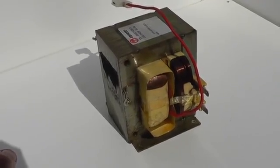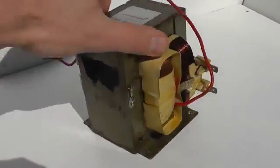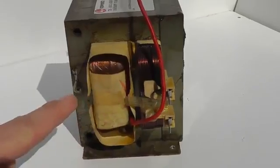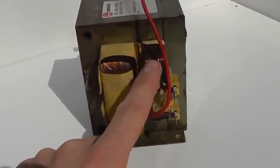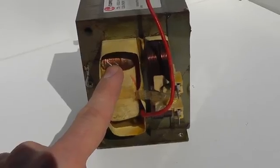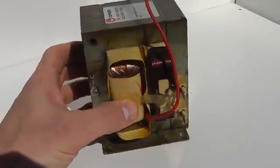In this video we're going to be looking at transformers, and here's an example from my microwave oven. It consists of two coils, a primary and a secondary, and these are surrounded by a very substantial piece of iron. The iron goes through the middle of these two cores — this is what we call an E-core, forming an E-shape with an end plate on it. The primary is much thicker wire because it carries more current, and the secondary has a lot more windings. Basically, this transformer has 240 volts in and around 2,000 volts out — it's what we call a step-up transformer.